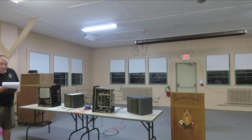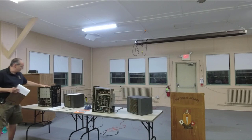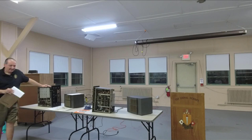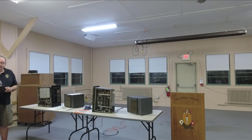No. Maybe I missed that. I had a note on that. Single side band didn't become important until after the war. Yeah. I was trying to pick it up before I had the BFO on. The BFO injection in this, I think, is a little low. But I had a real strong side band station, and I wasn't able to quite copy. John, I think it's got so much gain on it that it is probably drowning out the BFO.